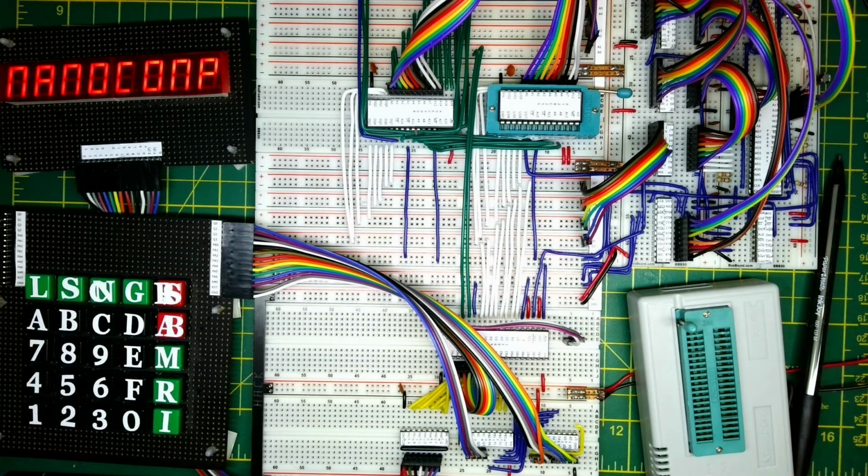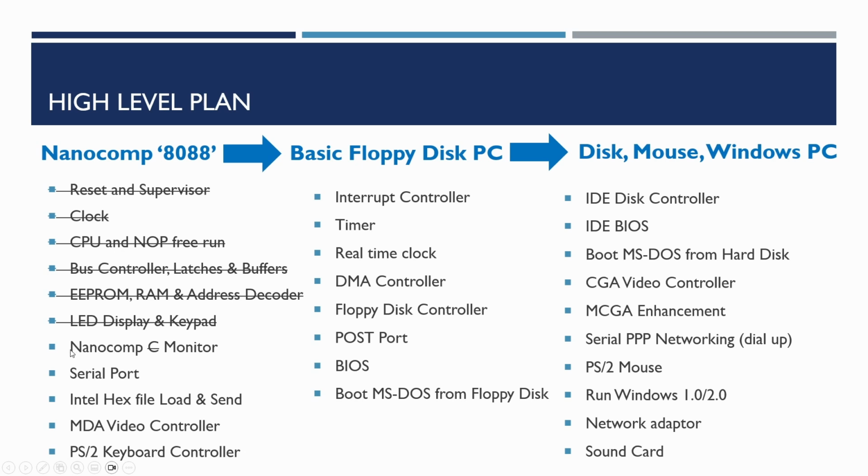Let's just reset it and get our Nanocomp back. What this means is that we should then be able to convert the rest of the 6809 monitor code into 8086 assembly language. I think it's going to be easier to do that using the mechanism I've shown you than trying to go down the C approach. So in the next video, I'm probably not going to convert the original Nanocomp monitor into C. I'm probably just going to continue with my conversion of the 6809 code directly to 8086 code. So that will be in the next video.